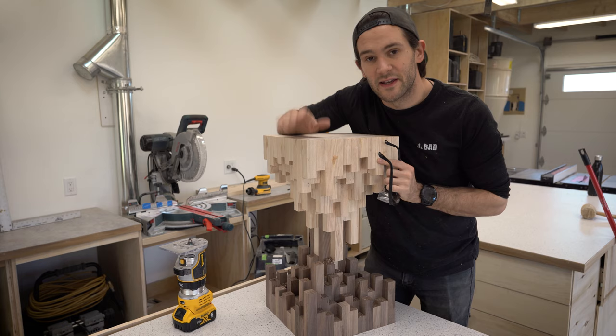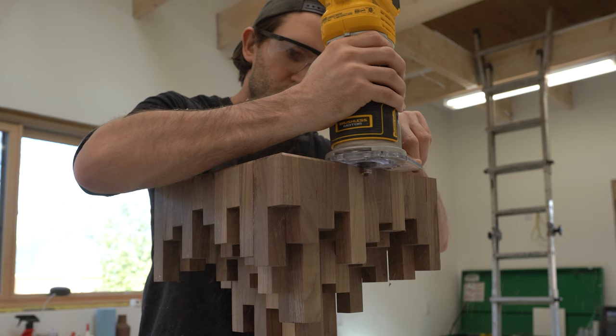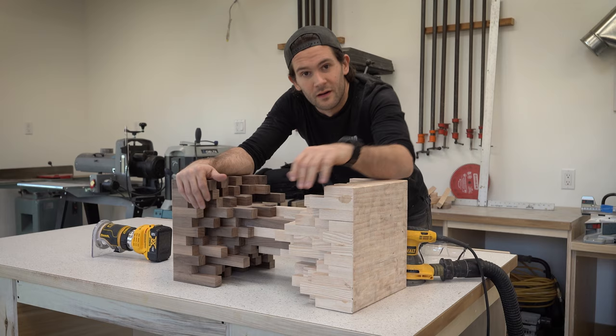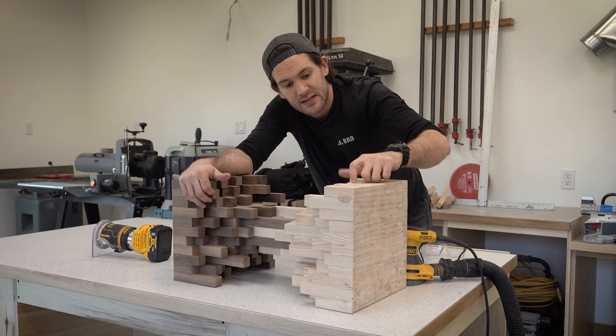The ash side is done and we have a nice flat base. It's not exactly perfectly smooth but it's definitely a lot better than it was — I'll take the rest away with the palm sander. Nice and flat, nice and stable now. I'm going to break this edge with a little round-over bit on the trim router and then we can move on. This is looking pretty cool now. I have to give the whole thing a good sand, do a little bit of wood filling, and then we're ready to move on to the finish.